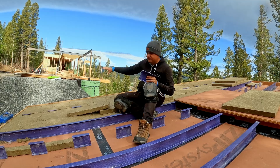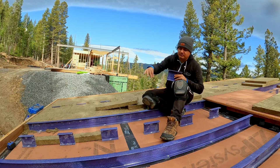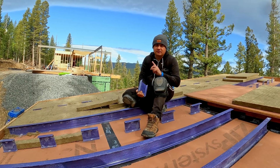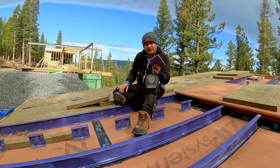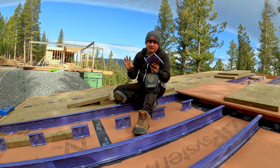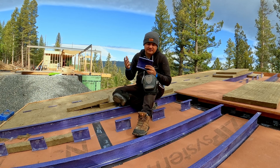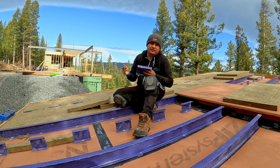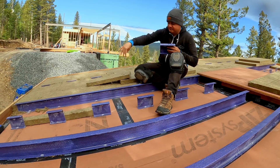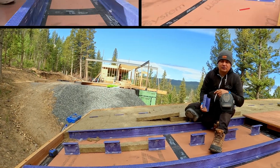Let me tell you what's going on here on the roof. You might see we have small pieces and then a large one — small piece, large, small piece, large. That's mainly to save on material because it costs a lot of money to ship it all the way from the east coast. We are cutting them at six inches and then putting them every 16 inches, giving us about 40 percent material utilization — that's six divided by 16. But we are also on the roof in the mountains where it's very windy, so we're also putting the full stick of C-girt to give the roof proper strength. We might not necessarily do this for the walls.